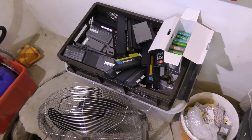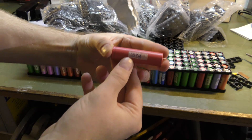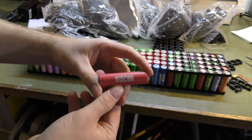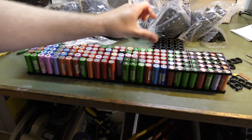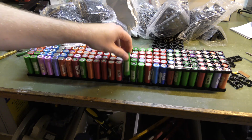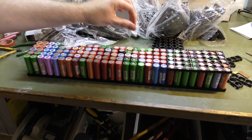I have some more laptop batteries that I haven't yet taken apart, so I think I have enough for probably three batteries. What I would do is check all the batteries and make sure what their capacity is — this one was tested at 1524 mAh. The goal is that the cells all the way through have to be about the same capacity. I would take out all the cells, add up the capacity, divide by 14, and that number is the target capacity for each individual stack of 10.